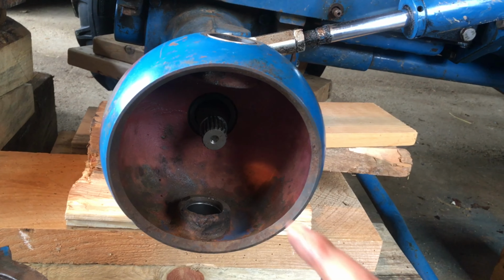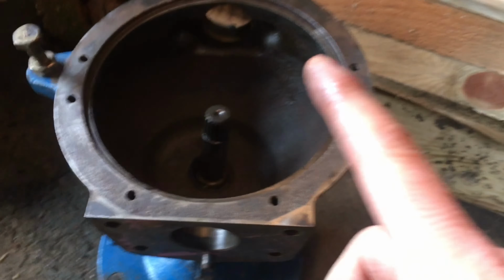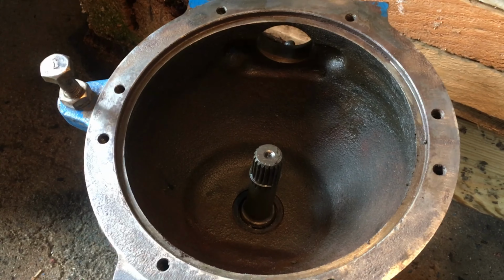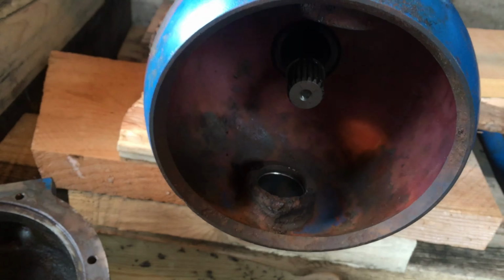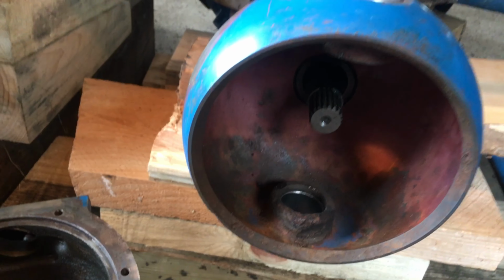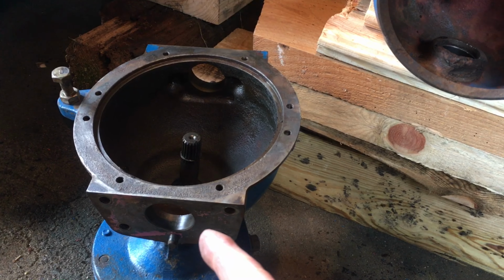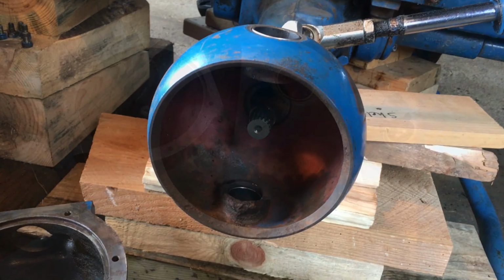Now that the Kingpins are set, I'm going to coat the inside of this with grease and the inside of this with a protective layer of grease. I'm also going to pack grease into the coupling that connects these 2 shafts together. Once all of that is loaded up with grease, we'll be ready to try and get this gear case and hub mounted back to the axle.